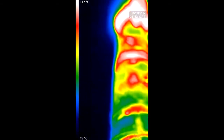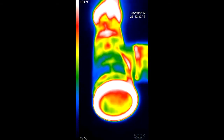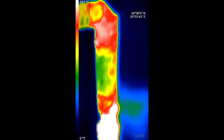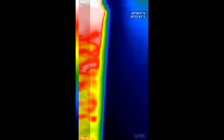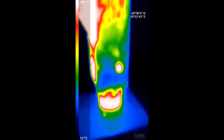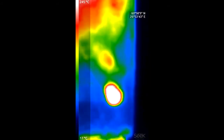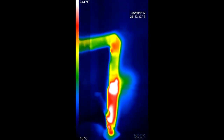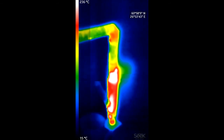I've got the thermal camera on here — it is 158. The room is at about 25°C. Here's the chimney and exhaust. The exhaust temperature is about 575. Now that is double wall chimney pipe there. We've got about 1850 still there — this is just churning away doing its thing. Let's stand back and get a macro view. We have far from an ideal heat exchanger on this yet, but it's sure doing its job and burning like it should.